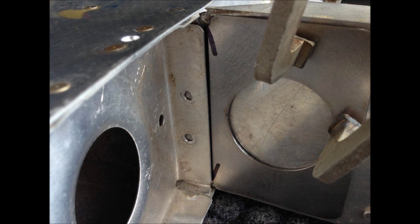You need to put a black line on the part we supply right where the bend is. There's a six-degree bend that we put in the stainless to follow the swept angle on the horizontal spar. If you put a black line right on that bend line, you can slide the stainless piece underneath the flange and see right where to stop — in the center of your line.